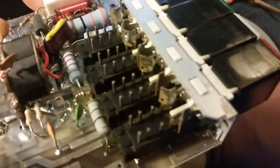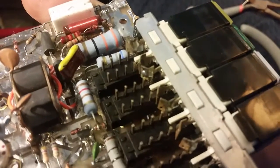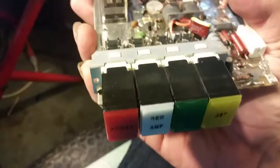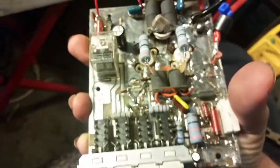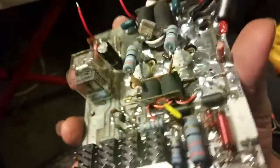I even soldered the tabs because I noticed the lights weren't coming on consistently - soldering those tabs will fix that issue. But that wasn't the issue here; these switches just went bad. The power switch is completely bad, preamp is touchy, SSB is touchy too, and the AM seems to be working just fine. Looks like somebody already retuned this amp for these 492s, so that's good.